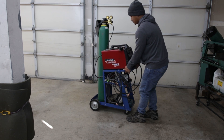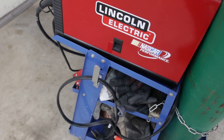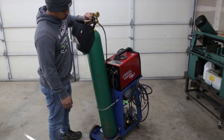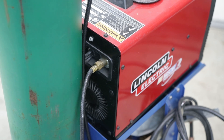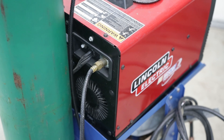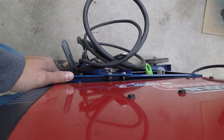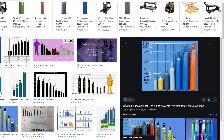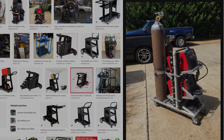This was my previous setup — a cheap Harbor Freight cart that came with the welder when I first bought it off Craigslist. After using it for some time, I found out what I didn't like about it. The main one being that the tank was too tall and heavy, causing it to lean, which would sometimes kink the hose connecting the tank to the welder. The other issue was trying to go mobile — it was difficult to maneuver because the whole frame would flex, making it feel pretty flimsy. Because I was going to run dual MIG and TIG in the near future, this cart wasn't going to work anyways.